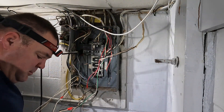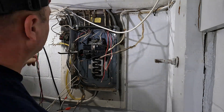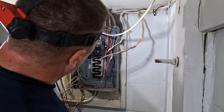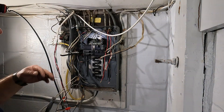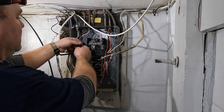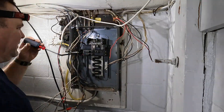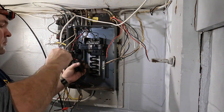There were also a few multi-wire branch circuits — that's what we call it in the trade. It's really a three-wire circuit with a black, a red, a white, and a ground. What's unique about those circuits is that we don't install them too often anymore, because everything new needs to be arc fault nowadays. With a multi-wire branch circuit, you have two circuits sharing the same common neutral, which was fine for many years, but now with arc fault requirements, unless you have a double-pole arc fault breaker — which costs a fortune — you normally just run two-wire circuits.